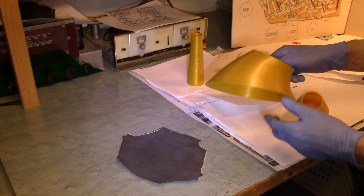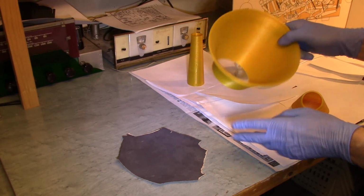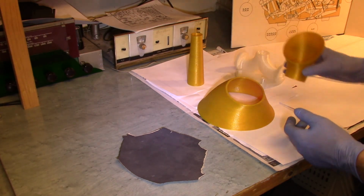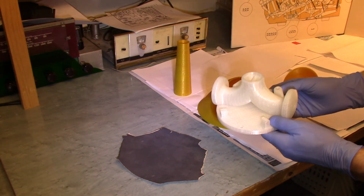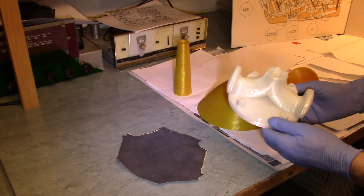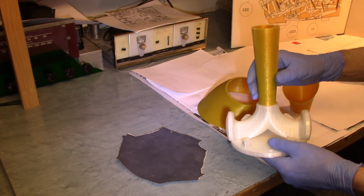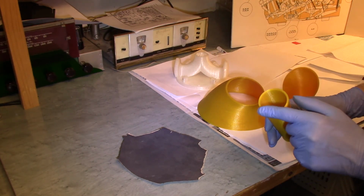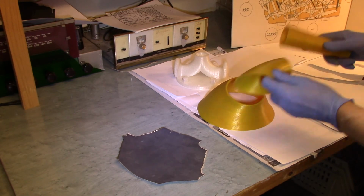Okay, so I got all the 3D printed parts done, the outermost horn. Obviously the limitation was ultimately this guy, he's the biggest guy, as much as I could fit on the bed of my printer. And there's kind of a neck. I had to break it up into three parts. It was able to fit in for the cone, a horn section, then of course the main section where the ear pieces actually stick together and manifold together. So this guy has a nice little shoulder in it for this guy to sit in, and I had toyed with the idea of designing shoulder features on these two, but that would have made the wall thickness even thicker, so I'm taking the gamble of butt gluing these together.